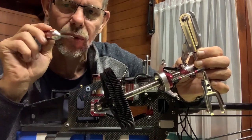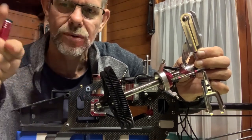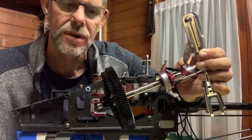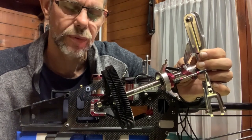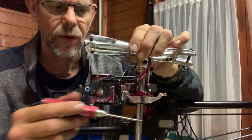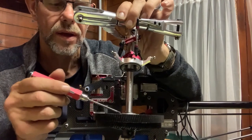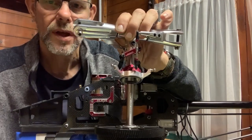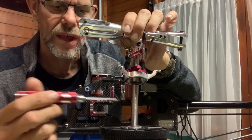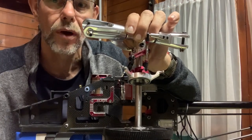On one side there is a very clear round circle inset where the head of the bolt goes through, and on the other side it is hexagonal-shaped in order for you to seat the nyloc nut. Don't get those around the wrong way — make sure you orientate that as you put it in. Essentially what we've got to do is put the main shaft through the bearing blocks and then seat it into the main gear at the bottom, always making sure there is something in those holes.